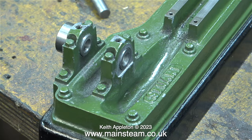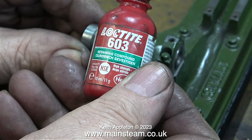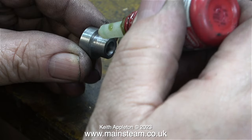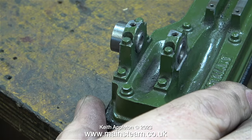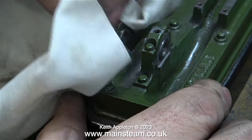I was going to make the bearings longer, but decided not to in the end — I felt it would look like a repair if I did that. Now using some Loctite 603, I'm fitting my special bushes into the bearing blocks. I'm using a generous amount to make sure it's firmly stuck into the hole. Loctite 603 and paint don't mix very well, so after fitting the bushes I wiped off any excess with a cloth.